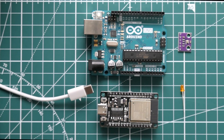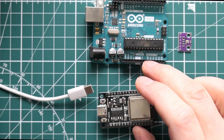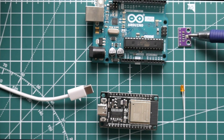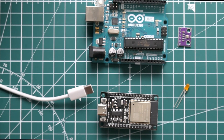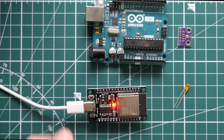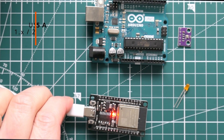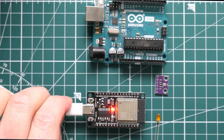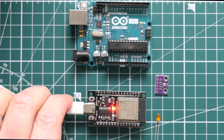Let's not over complicate this. If all you're doing is using a microcontroller — be it Arduino, ESP32, Raspberry Pi Pico, whatever — and some simple low power sensors like a temperature or humidity sensor, or you just want to power some LEDs or use Wi-Fi, your best option is simply to use USB. Here I've plugged my USB-C cable in, and on the V-in pin you'll get five volts. Connect your five volt sensor to that pin and it will power it; connect an LED to one of the outputs via a resistor, turn that output high, and the LED turns on.